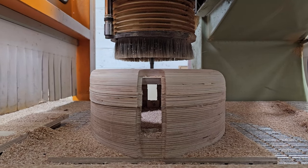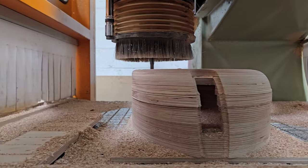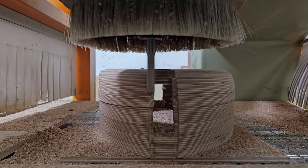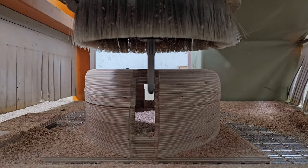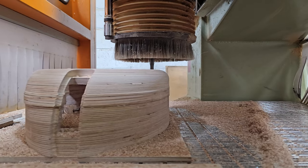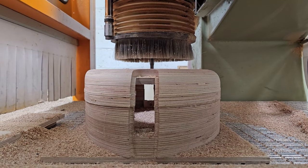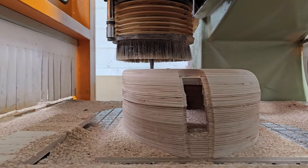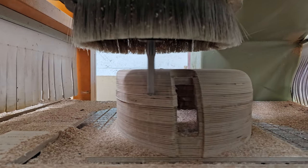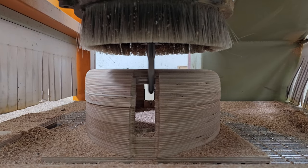My feeling is for this kind of stuff, and part of the reason we can get such good surface finishes and so consistently, is that if you're getting dust off, you're not cutting enough material. So even though this is a finishing pass, I could have left half a millimetre of material so that this tool really wasn't deflecting. I've left a good 2 mil, so it's got something to really go at.